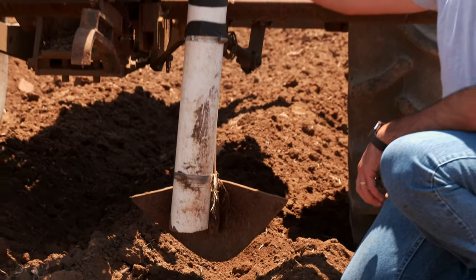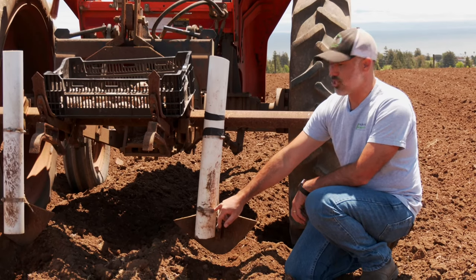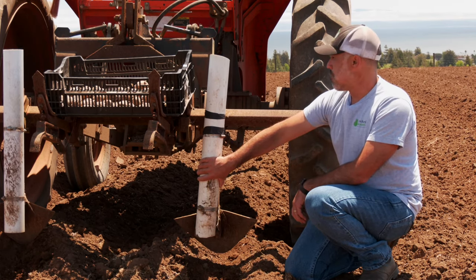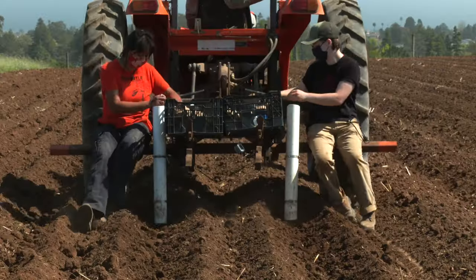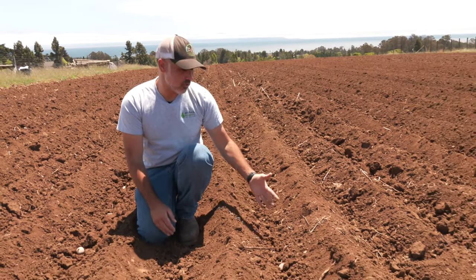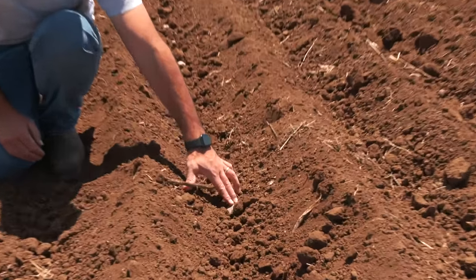Attached to that shovel is just a piece of three-inch PVC pipe — most of the time we have it attached with hose clamps, sometimes stronger tape if the hose clamp isn't holding. We just have it attached to the clamp so it stays nice and steady. That's really it. We drive slowly, make sure we set our depth right so the potatoes get buried not too deep and not too shallow, and it works like a charm. Here's a bed we've planted and I want to show you what it looks like after the process.